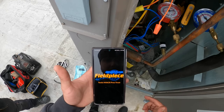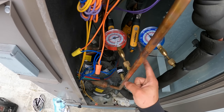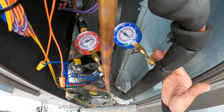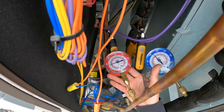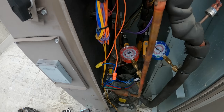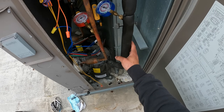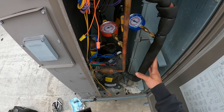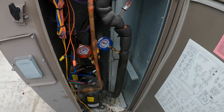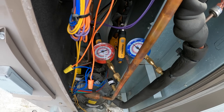At about 55 degrees, R-410A should equalize at about 156 psi. I've got my digital gauges on — I'm at about 160 pounds on the low side and about 170 on the high side. So this circuit — which I think is number one — this one looks okay. Let's get the gauges on the other side and check the standing pressure.